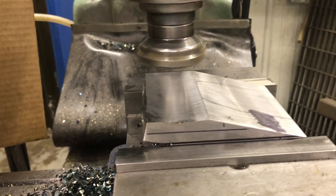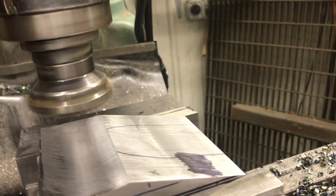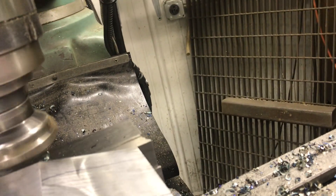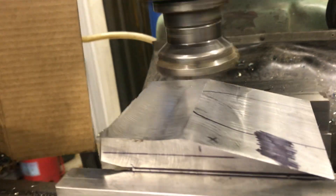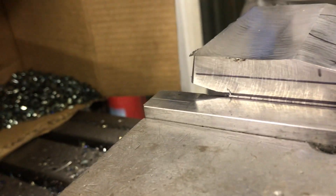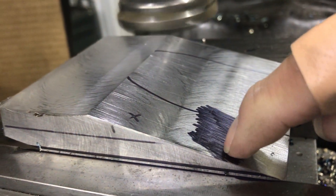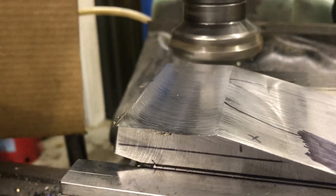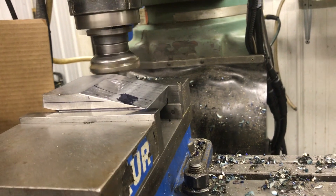I'm going to turn my spindle on. I don't think I've raised my table up here yet — nope. You've got to pay attention to where your cut's at. I'm going to go up a hundred and fifty thousandths — that's a turn and a half on the handle on the milling machine. I've taken a bunch of cuts already and I've got to get it down to this line right here. An inch and a quarter from the edge of the piece up to that line is where my angle has to stop, so I've got probably three-eighths of an inch to take off yet.